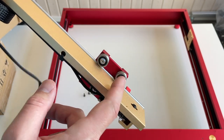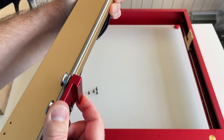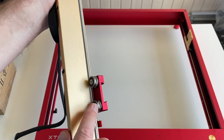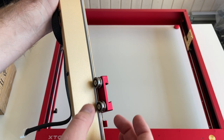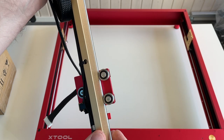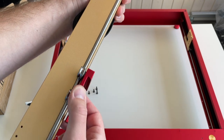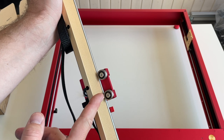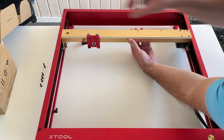There is one bearing here and two here, and it works pretty well. It's super rigid — there is zero play. I really like this idea. I think it's way better than V-shaped aluminum profiles with plastic wheels. I think it would be nice to also make a 3D printer with this kind of moving system. Actually this moving system was the main reason why I chose this laser cutter over others.